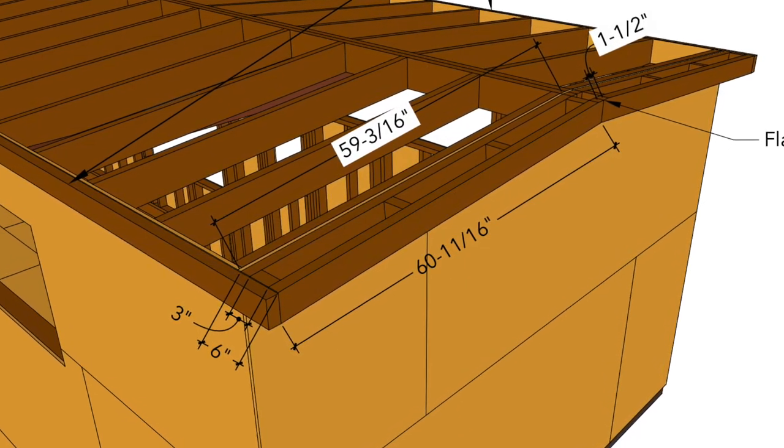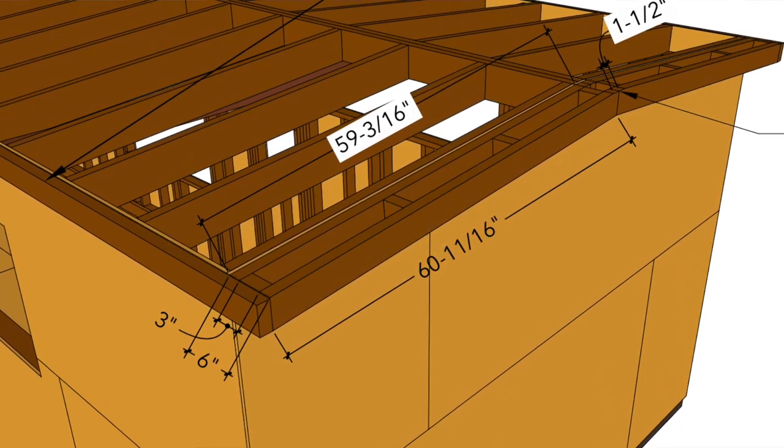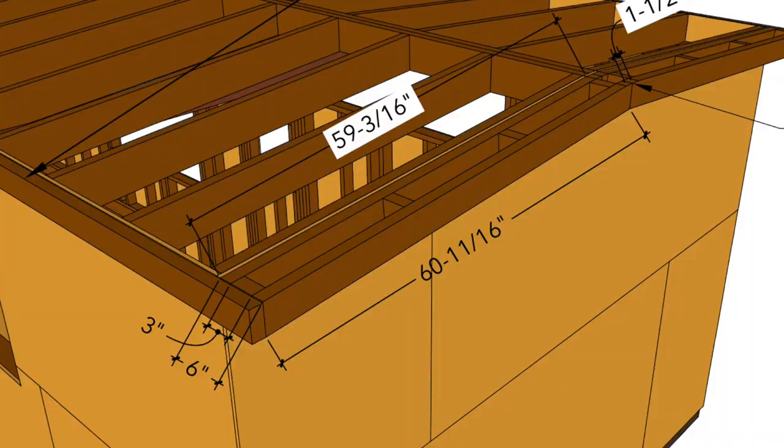I also had to buy a few more 2x4s because after we put up the sheathing on the walls, we had to add the eave for the roof to go on top of. That was fun. On the front and back, it was just a 2x4 along the whole length. And on the shorter sides, it was an eave that came out about 6 inches. The front and back sides were only the 2x4 because of restrictions for when the trailer's on the road, so it can only be a certain width.